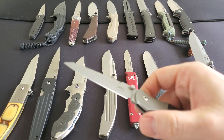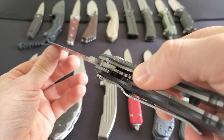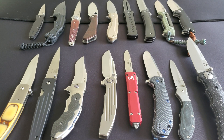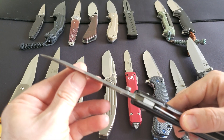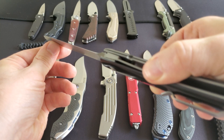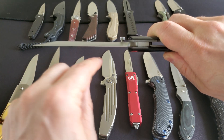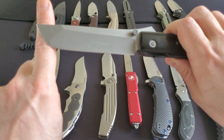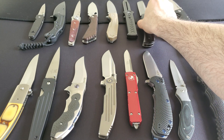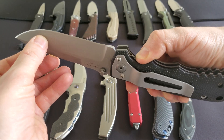What we do have control over is the grind and blade geometry. Personally, I find a slimming triangle kind of grind and geometry works best for me. This grind here — I believe it's called a chisel grind — you can see how completely different the blade shape is: a completely straight line and the way it's blade-shaped. So this knife will perform differently than this other knife based on its geometry and grind. That's something we as users have the ability and control to choose.